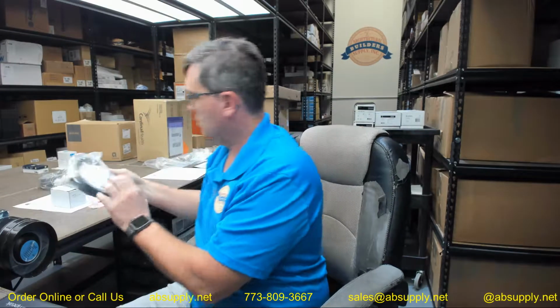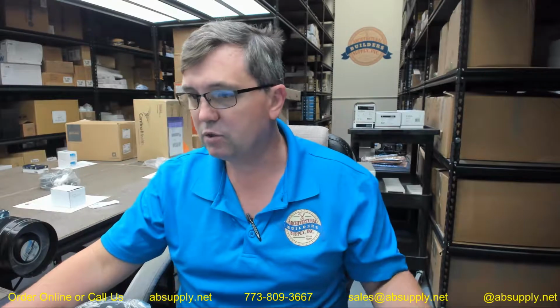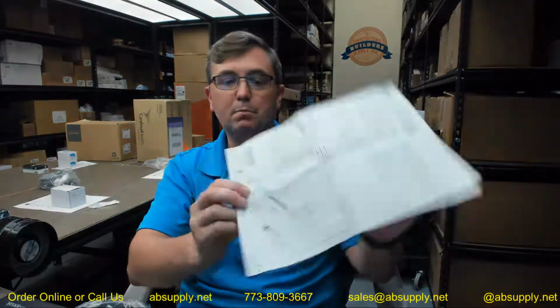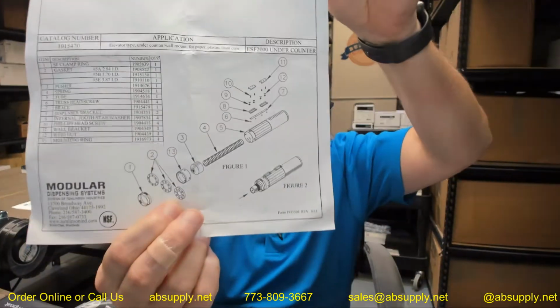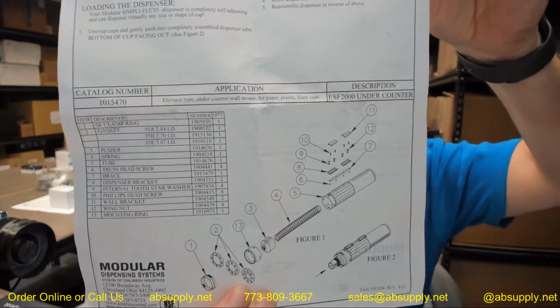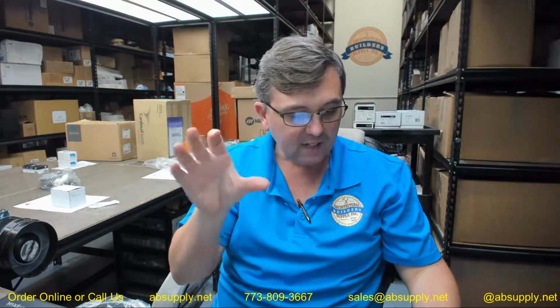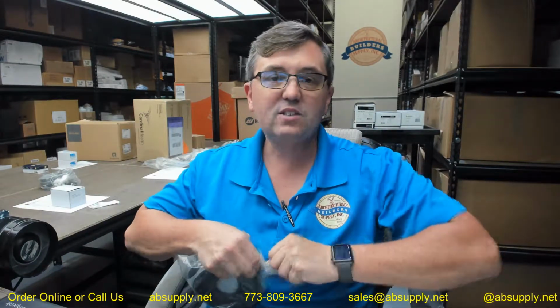Okay. Ships with 3 gaskets. And the 3 gaskets, and I don't remember which gaskets it comes with, but let's see if we can tell. Oh, we can tell you. First of all, there's a link below this video to a document called Instructions, and that is what's included with the material. And they are listed here as part number 2 on the item. And part number 2 is going to tell you that you have a 5A, a 5B, and a 5E gasket. And what's on there is telling you the ID. And that's the diameter of the cup.